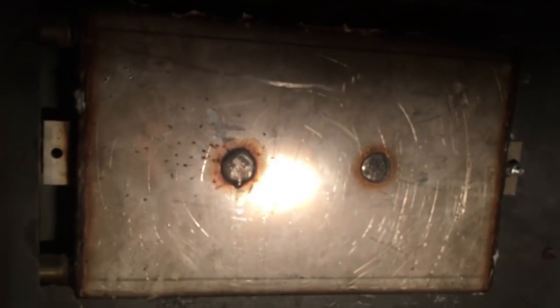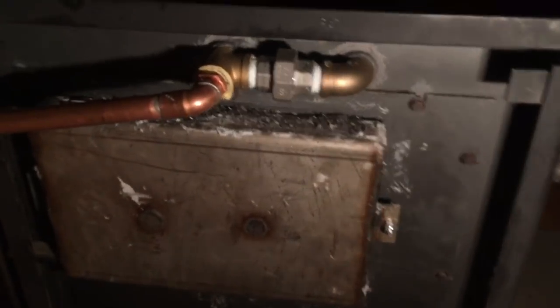What we have here that's a little different from systems I've done in the past is kind of this afterburner, turbo-type system, where we have the boiler — a stainless steel boiler — and we have a hole cut in the firebox so the fire can access part of it. You can see how there's a hole cut in the refractory. I could cover that hole if I wanted and it would still heat up — that just gets the thermosiphon going.